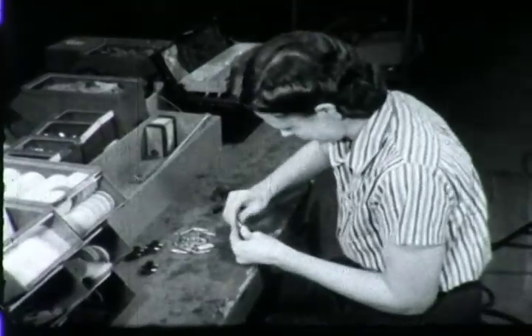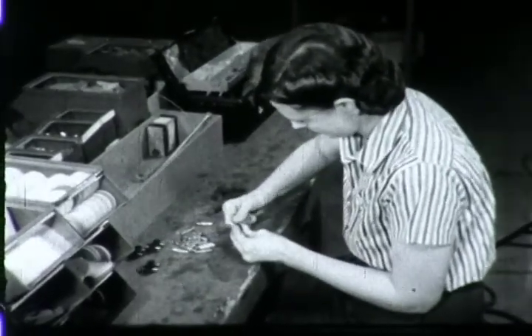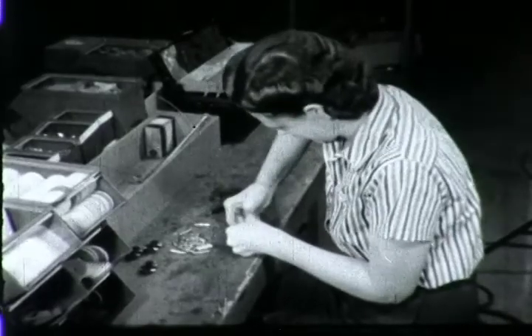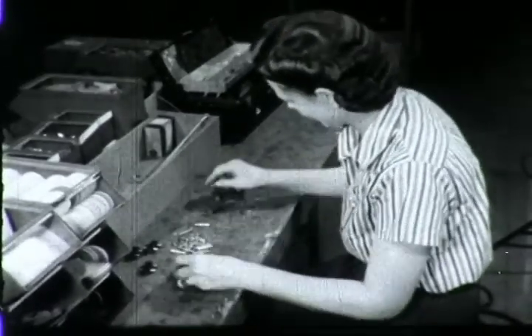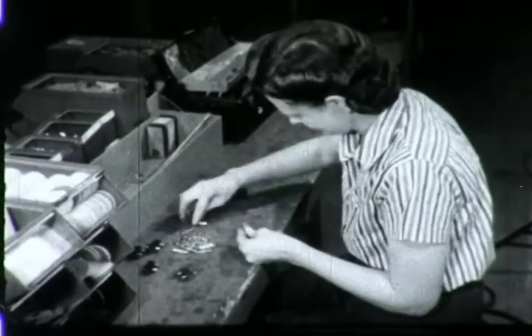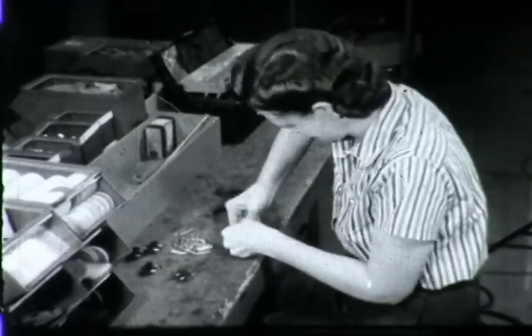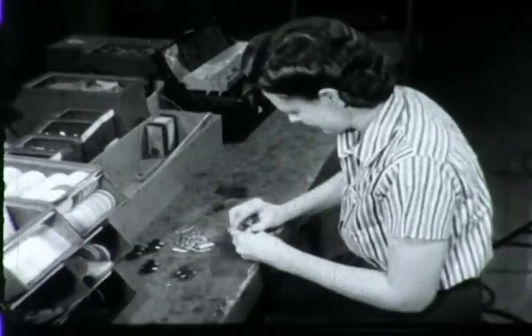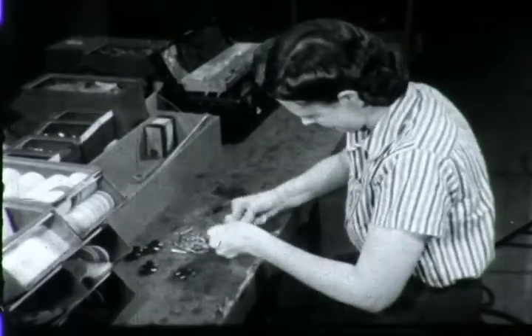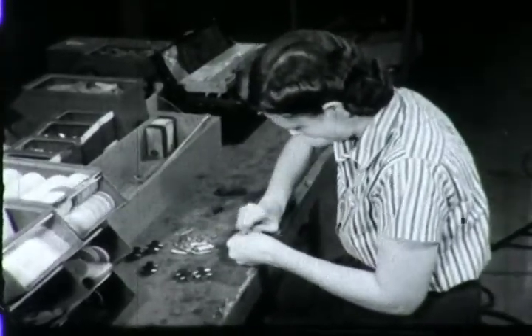And here is another one-arm bandit. She is placing spare fuses for the Basic Trainer in rubber fuse holders, which are then stowed in junction boxes in the ship. The holes in the rubber are cut undersized, necessitating a press fit, so the fuses will be securely held under vibration. Is her left hand doing constructive work? No. It is being used as a holding device and is idle.